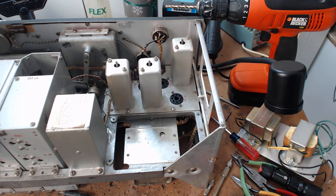I already have one BC-348 with the dynamotor in it. All I had to build was a 24-volt DC supply - you hook it up, turn it on, it lights all the tubes because it's all original. The dynamotor as it spins makes like 250 to 350 volts and the radio works fine, but you can hear that dynamotor spinning in there. So I'll build another one of these power supplies.